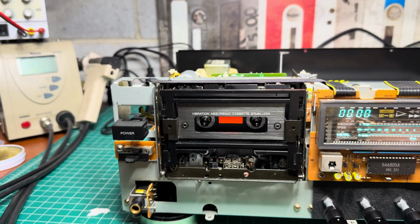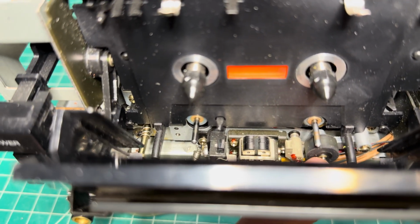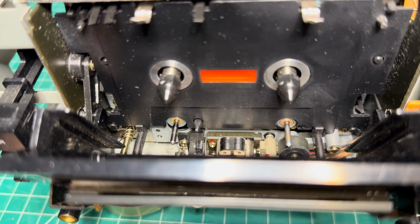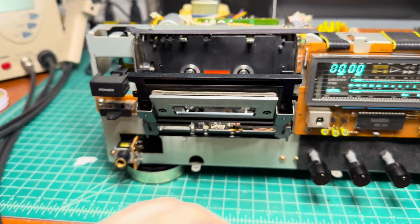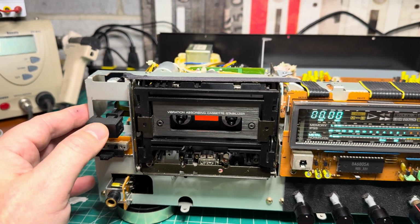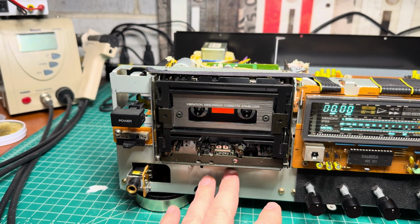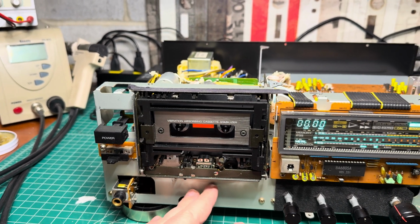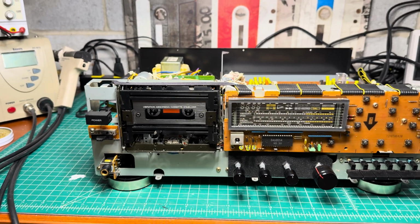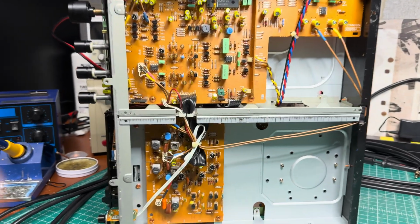You know what? You see, those have just a single E-ring holding them. Remove the E-ring and replace the pinch rollers, as easy as that. Alright, so it still works somehow. Now I will remove the bottom part and pull out the tape transport and let's see in detail what's really happening there, and if someone was working on it and what they did before. See you soon. Alright, I opened it from below.